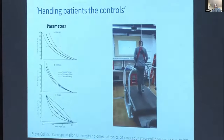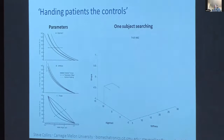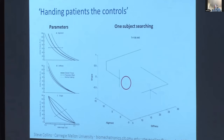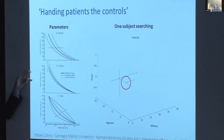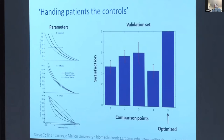Another strategy that we're investigating, aimed at augmentation, is based on a heuristic. Here we're assuming that when you have activity in your muscles, you want torque from the device for assistance. And so on each step, we measure EMG, and then we add a scaled version of it to desired torque. And this occurs over hundreds of steps. You can see over time, the person's muscle activity is decreasing, and the torque applied by the device is slowly increasing. And note that this is not the same as just taking a snapshot of their EMG and then playing that back, because it's occurring slowly over time. So the person is adapting to the device, and the device is adapting to the person at the same time.